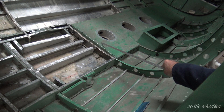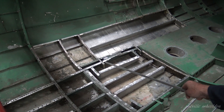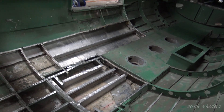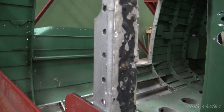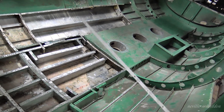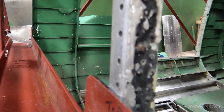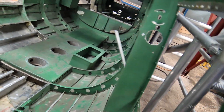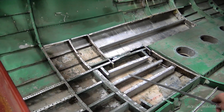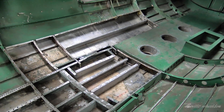This bit here — the formation lamp casting, it's a magnesium casting — should be up here. You can see the remains of the hole in the skin where they've patched it over. So they moved it all the way back to fit the radar. Is that going to cause a problem? Not really. You just need another former mount put across there, because these two here are homemade ones. We delete them and turn it to the former — it's not a problem.